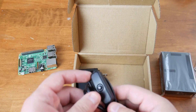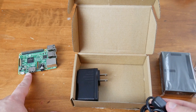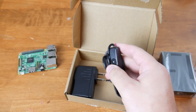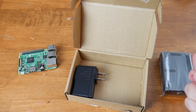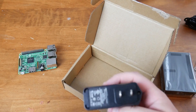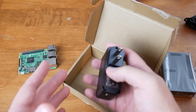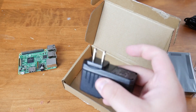There's also a cable here that has an interrupt button, because this technically has no power button unless you install one. This makes it really easy because you can just use it to turn on and off. Otherwise you have to unplug it, which can affect it unless you shut it down correctly. It also comes with a pretty strong power brick — a 2.5 amp brick at 5 volts, which is perfect. That's plenty.